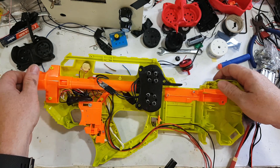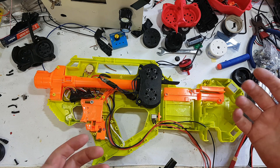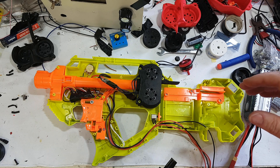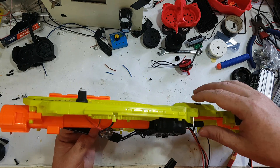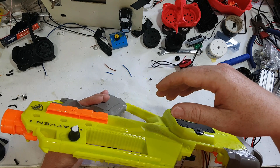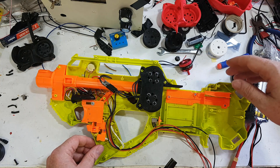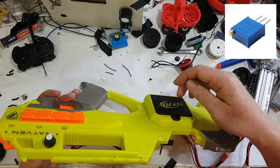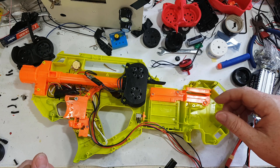That was the most requested addition to the project. It's really useful for people who are restricted to a certain FPS — if you can't do plus 200 FPS or whatever and you're limited to 130 or 150 shooting some specific kind of darts, you can now adjust the RPM to get exactly the right limit for whatever dart they select. This one is obviously never going to be legal because you've got a knob on the outside, so I just put an external knob on for basically kid-friendly use. If you were in a restricted battle, I'd suggest a multi-turn trim pot which is much smaller — you could put it in the original battery bay or in the shell where you can't access it during the battle.